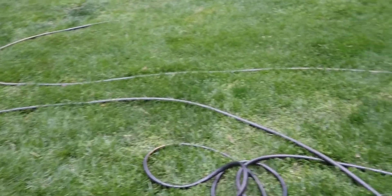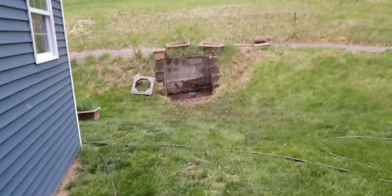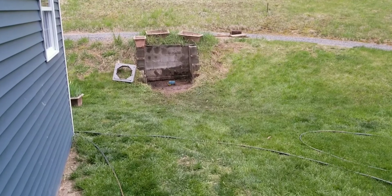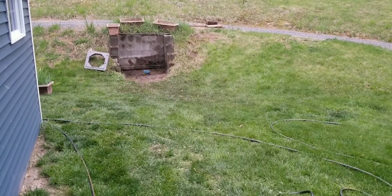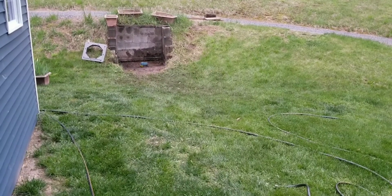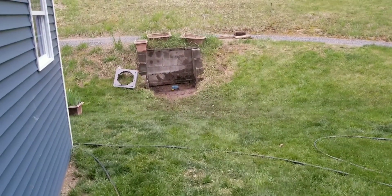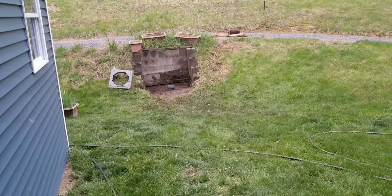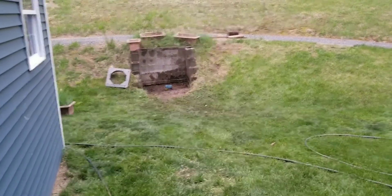Don't try this at home, because that hose could burst if you get too much pressure on it. But I thought you'd be interested to see a little geyser action. I think it's really going to help my well out. I went from 77 feet to 81 feet on my well depth — that's where my pump is. I was able to remove eight feet, three inches of sediment. My well got eight feet, three inches deeper. I think that's really going to help. It took 48 years for that sediment to get in there — well, I assume it did.